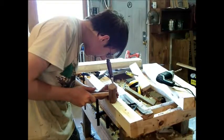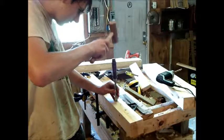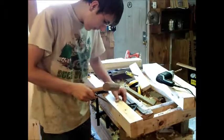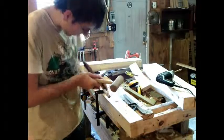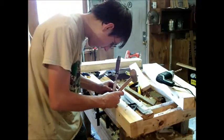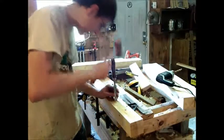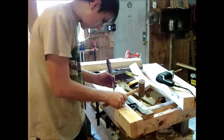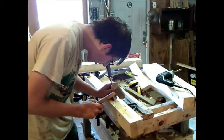I'm going to finish this first bit and then I'm going to sharpen this because it's duller than I remembered it being. You just pry your bit of waste out every time. You're not ruining any of your good wood because you're prying onto your waste. I'd say we're already a quarter inch deep.